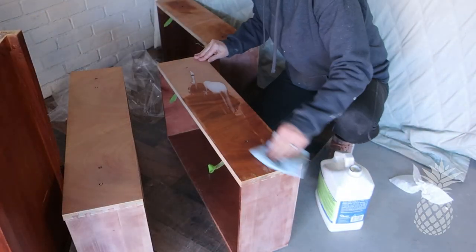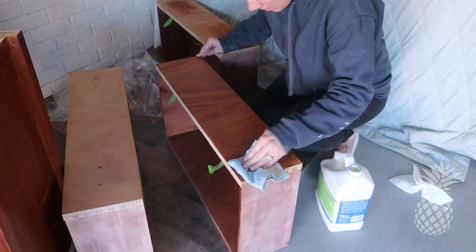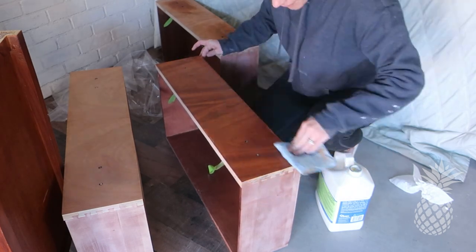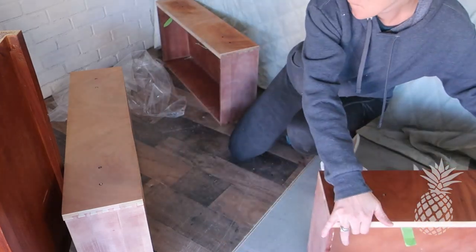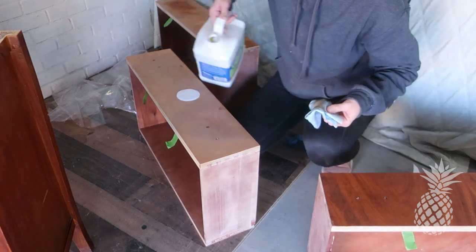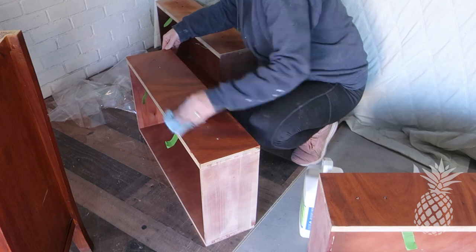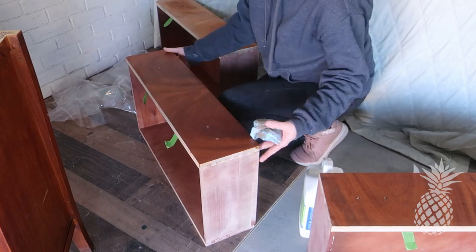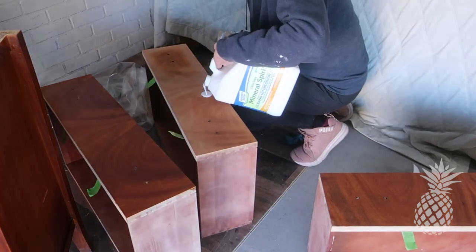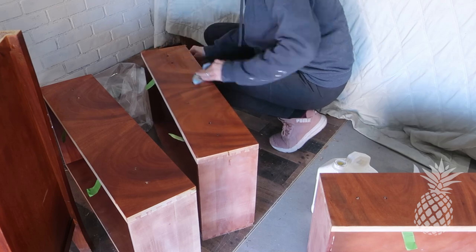Before we stain or poly wood pieces, we want to make sure that there's no swirl marks or any flaws, because you guys saw that I was wood gluing those little dowels in, so I want to make sure we sanded all that glue off, otherwise it's going to leave a huge mess. So by wiping mineral spirits all over these drawer faces, it shows us exactly what it's going to look like with poly on it. And thank goodness we sanded enough. They look amazing. They do.